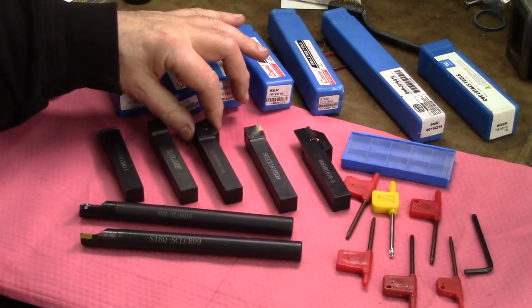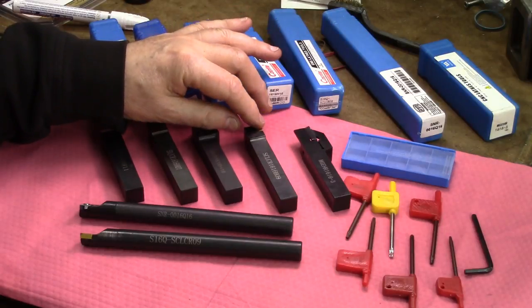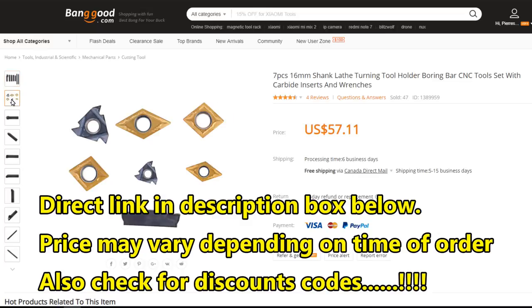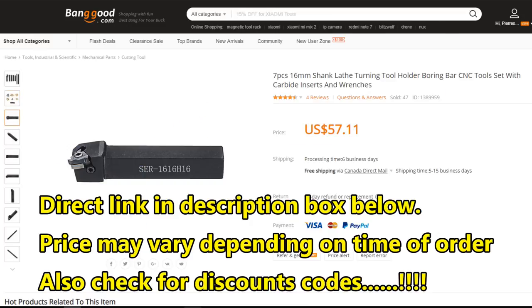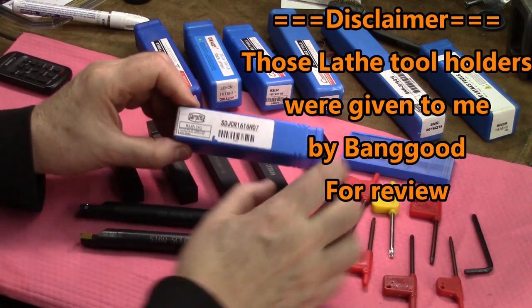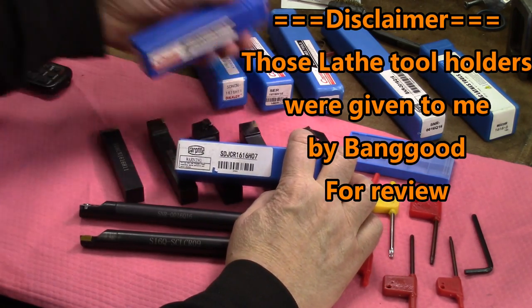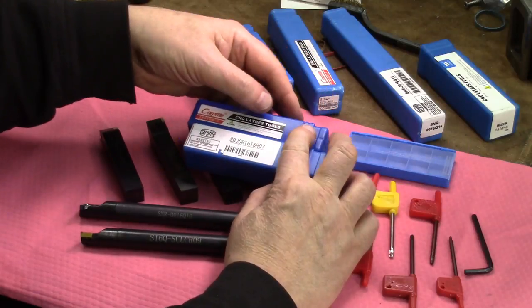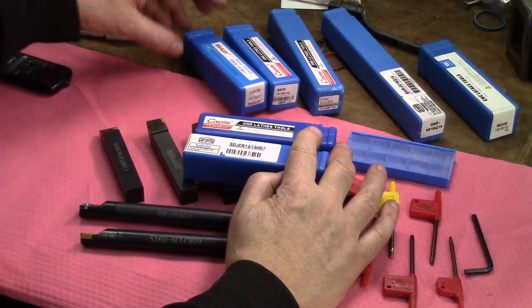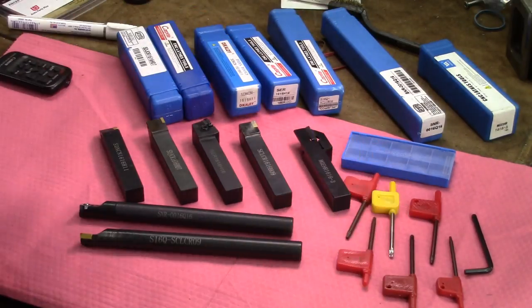It's for a medium size lathe. It's BXA blocks that you would use them on. They're 16 millimeters by 16 millimeters square. You'd be using them on the BXA, which is a 5/8 in the imperial system. They all come from different companies, I would say, because we can see they're not all made in the same place, but I don't think that would make a big issue.